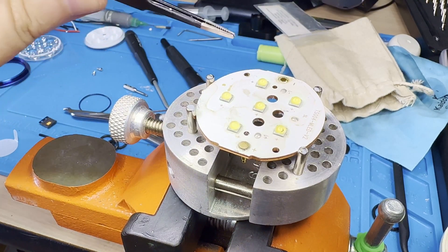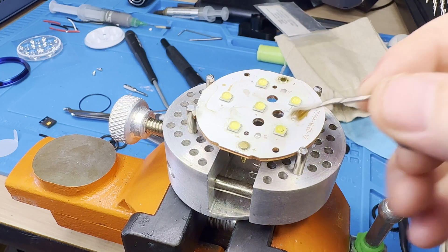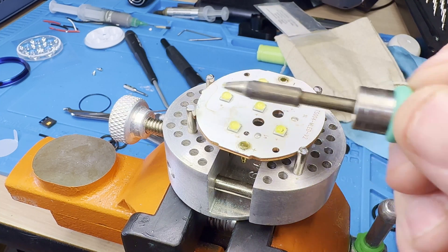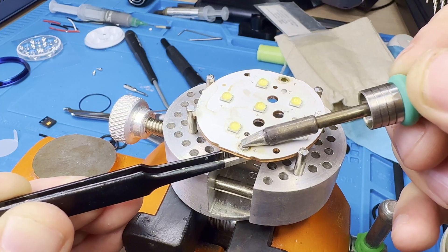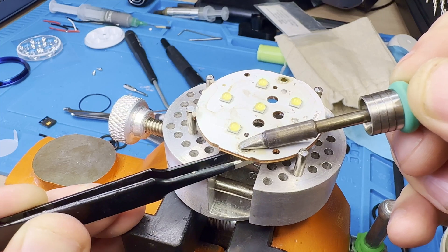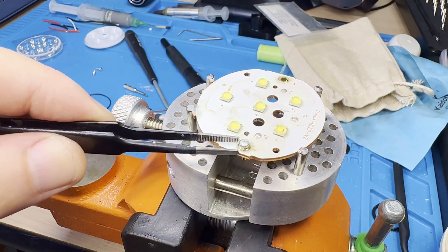I got the pogo pin out on the other side. It's like a pogo pin that connects the top MCPCB to the bottom one — for grounding or something. I found the technique I like to remove it: I tried hot air and it was tragic as usual. Instead I put a bunch of flux on there, set a really wide tip to about 400 degrees, grab the pogo pin on the bottom and heat it up, getting a lot of contact. Once it gets all melty, I push up from below and hold it for a second so the solder solidifies, then I can just weasel it out.